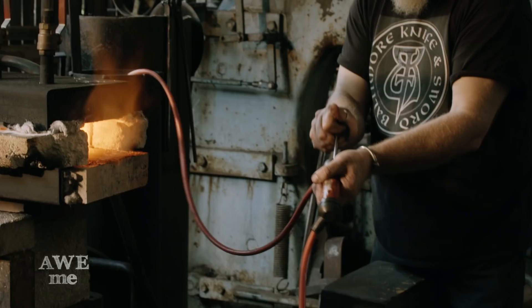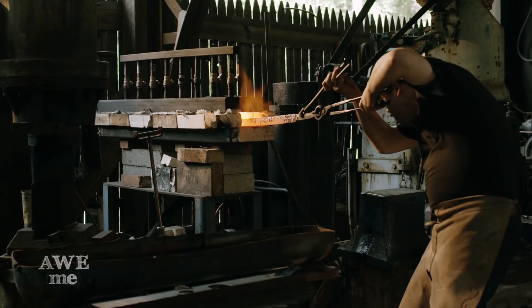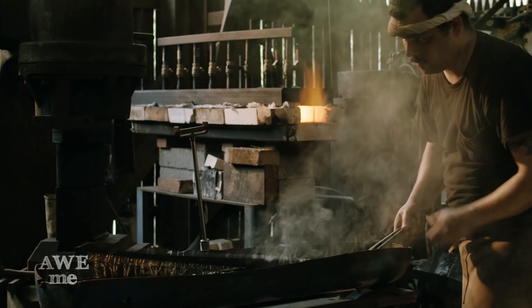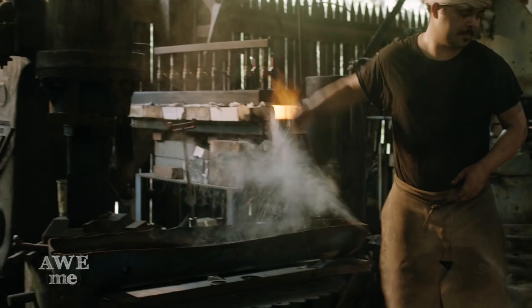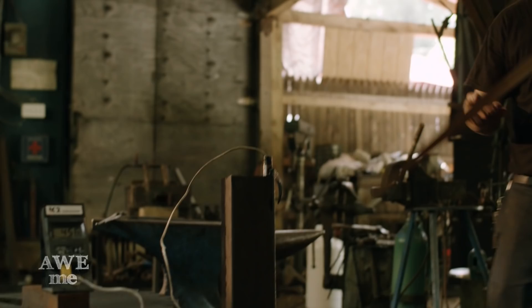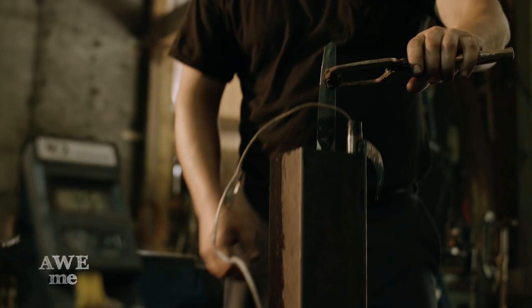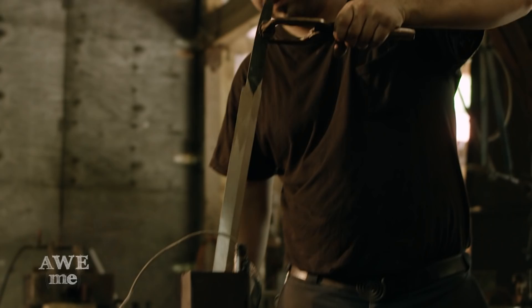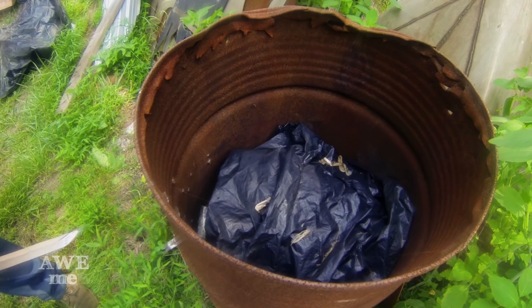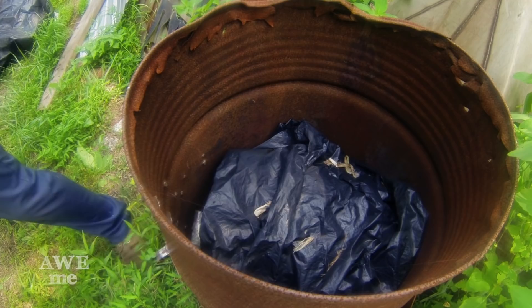After the blade has reached the right temperature, we then quench in the horizontal quench tank. We use a horizontal quench tank to mimic the effects of the traditional Japanese swordsmiths. Pulling the blade out of the quench at the right time gives you the ability to correct any warping. Using a technique I learned from John Lundemo of Odin Blades, I immerse the blade in a hot oil bath for tempering. To test the heat treat of the katana, I smite a metal barrel. After tempering, I sand the katana blade.